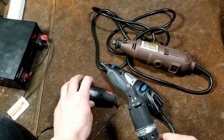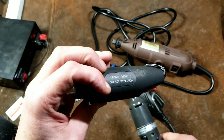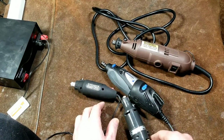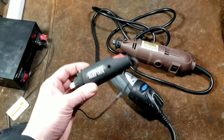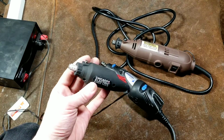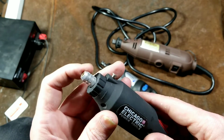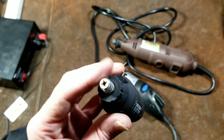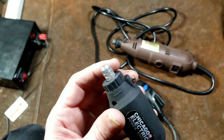And since this has a DC motor in it, you can easily put in a pretty powerful motor, but we can see that it has no ventilation or anything, so they're just trying to make it as cheap as possible and actually claim that it could possibly do real work. In reality, this thing can't do any amount of real work. It is just ridiculously underpowered, very poor quality, with a really loose motor and really loose spindle in there, and an aluminum chuck on it with a brass collet. And the brass collet's actually just fine, but the aluminum thread just won't last that many cycles.